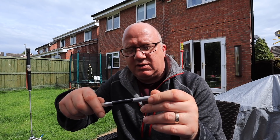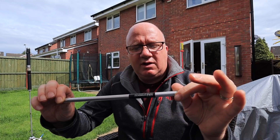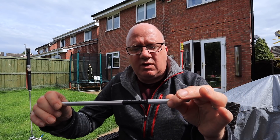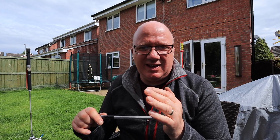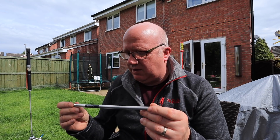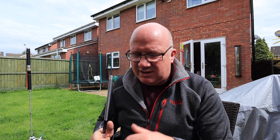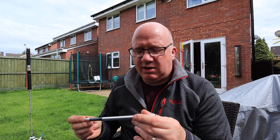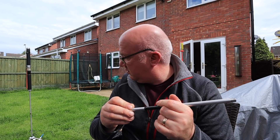Also with 2 metres you actually use this extension rod with the diplexer. So I do need to go and dig out the telescopic antenna, rather than — I use a titanium whip mostly with this. So I need to go and dig out the original telescopic, work out how I can extend this, because I haven't got a spare socket on the end of it. And then I'll be able to check and test it out on 2 metres.